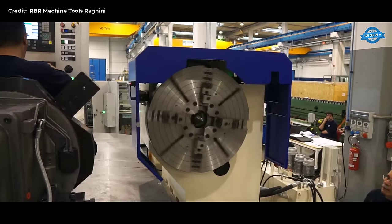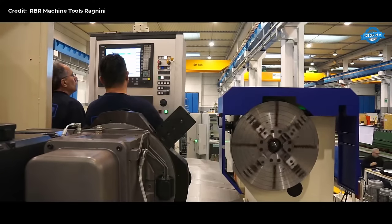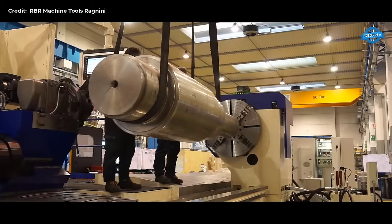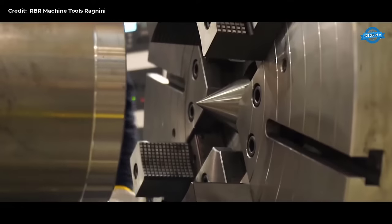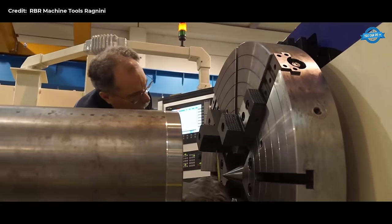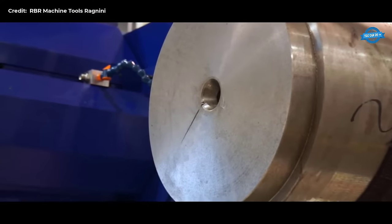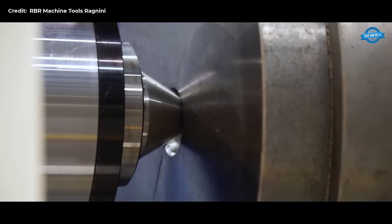At the heart of the HT lathe is its unique bed design. In models HT6 and HT12, the bed features 3 guides, including a split central guide, facilitating smooth carriage movement alongside the tailstock and any steady rests required for the operation. The HT22 model boasts an enhanced bed with 4 guides, further enhancing stability and precision.